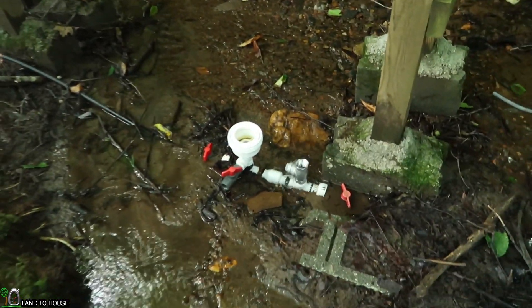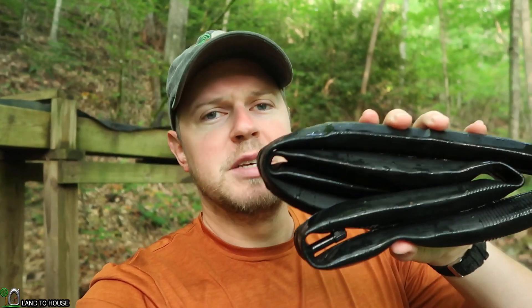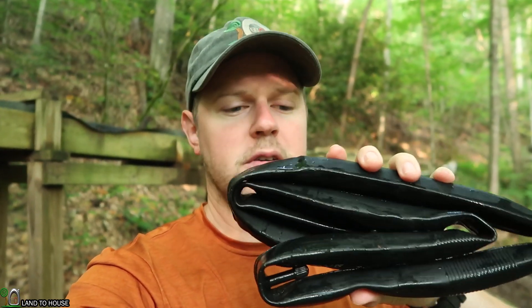If you're wondering why I put a bicycle inner tube in the ram pump pressure tank, it is basically a bladder that will bounce back whenever the pressure wave occurs. Earlier in the video you saw that every time it cycled it would bounce a little bit, and that basically just keeps an air bubble at the top of the tank and helps push water uphill. I'm sure there's a much more detailed explanation that I'm not 100% familiar with, but I do know that it helps. So far I've found that a bicycle inner tube is the best fill material. In a future video I'm going to be putting things like tennis balls, ping pong balls, rubber balls like racquetball, and just see what happens. Remember, I have four different sizes available at landahouse.com and on Amazon. Thank you for watching and I will see you in the next video. Bye.